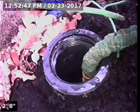Good afternoon. I'm Jeff with Sewer Tech Northwest. Today we're at property address 60 Northeast Graham Street here in Portland. We're located at the front of the home, off to the left of the front doorway. We have a three-inch ABS cleanout as our point of access. I'm going to insert the camera and check the overall condition and serviceability of the sanitary sewer line.